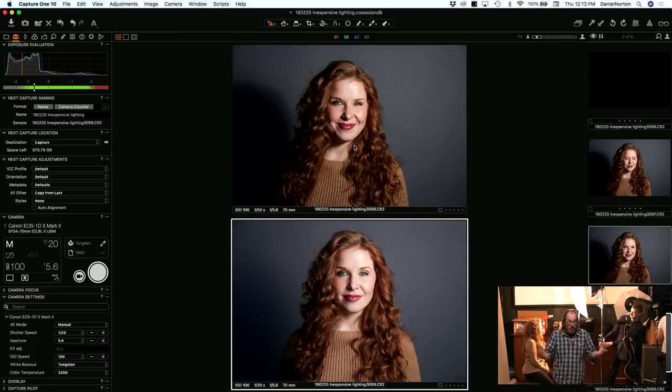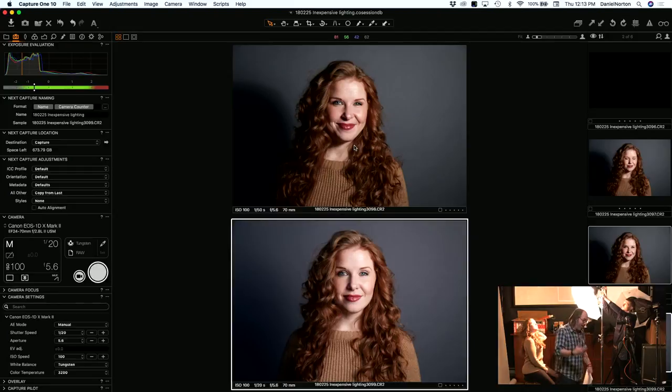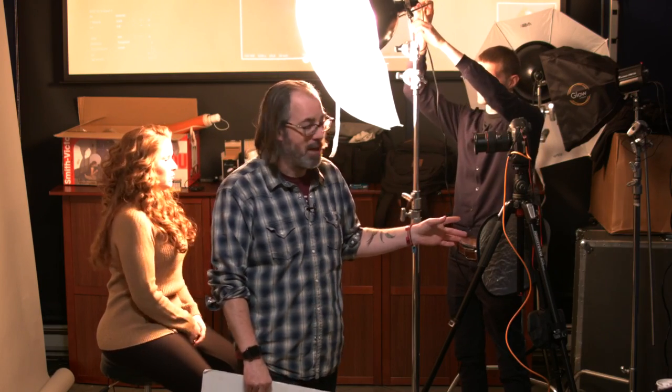So we had a question online about the power draw. So this is 500 watts, right? A typical circuit here in the US can draw about 1,800 watts max. So you could plug three of these guys in. You should be fine if there's nothing else major plugged into it. Yes, if you do this for a living and you're running these 8 hours a day, 5 days a week, it's going to cost a lot of money in electricity. I'm assuming that somebody setting up that kind of studio is not using these, I mean, at that point.